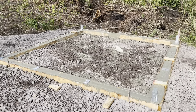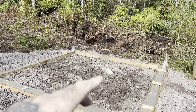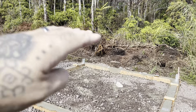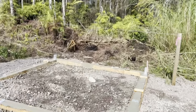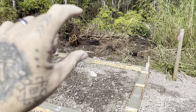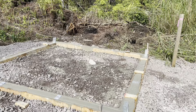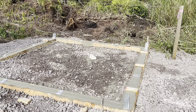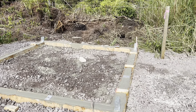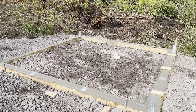Get all the forms peeled off, get those four corners put up. What I'm going to do is put the four corners up, put a laser in the middle, get my height for all four corners, get them marked and cut, put on my top pieces, then pop in the 4x4s on each location. That essentially is going to be the house, and it's going to be fully screened or fenced in. I have this nice galvanized fencing which is a small half inch by one inch hole, and it's 14 gauge - pretty heavy duty. It's actually the same stuff we're going to use when we build the Parrot Aviary.